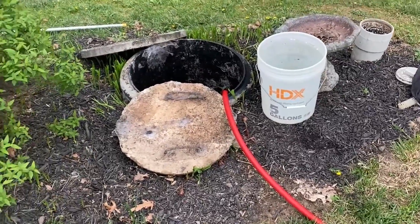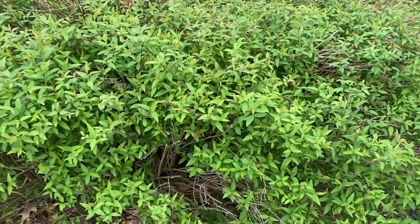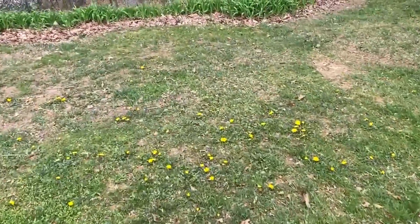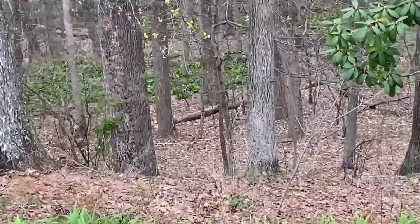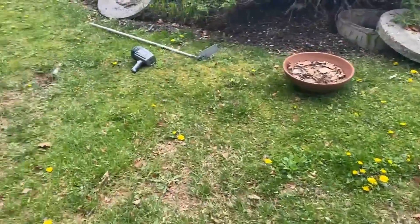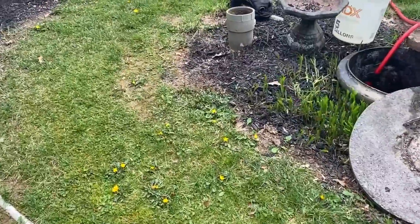Today we have a single tank to a pump chamber to drain fields way up the hill, way over by that pasture. In our area you'll generally only see a pump chamber if you're trying to move the water uphill or away from a bad soil environment. If we walk to the downhill part of the property we're going to see that it's a pretty aggressive slope and there's a little river way back there. You're not allowed to get close to a river with a septic system, so in this particular circumstance we have to get the wastewater up and to the higher part of the property.